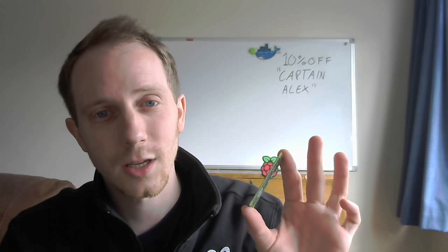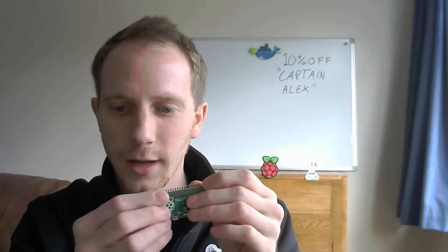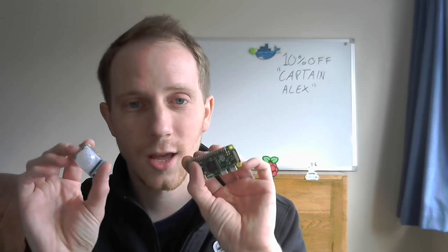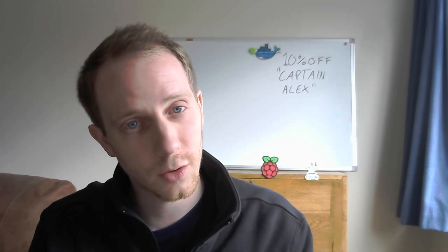I used this at DockerCon last year to produce a cool hack and showed it in the community theatre. That involved soldering on some headers, and each of these pins can be controlled by software. That enables you to add something like a passive infrared sensor — the kind you might have seen in a garden or security system — and when motion passes by it will trigger one of these pins high, and then in software you get the chance to send an email, light up an LED, take a photo, or do whatever you like.